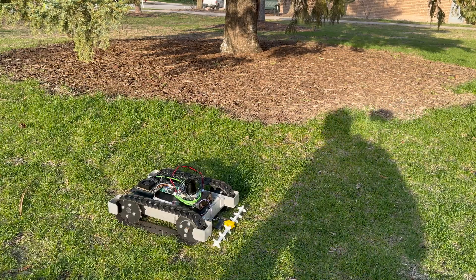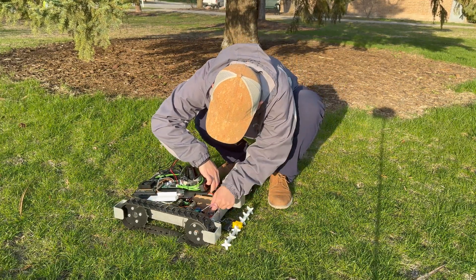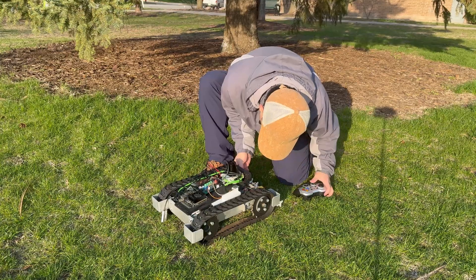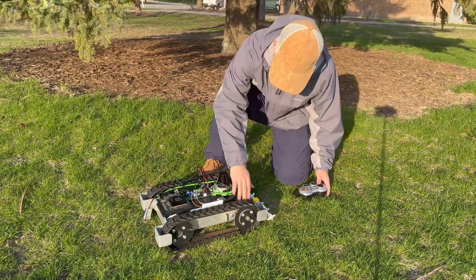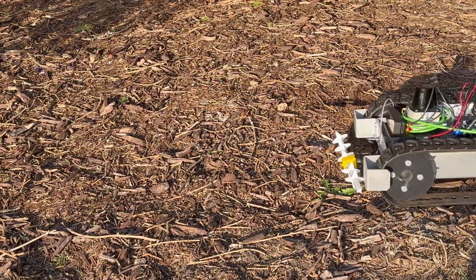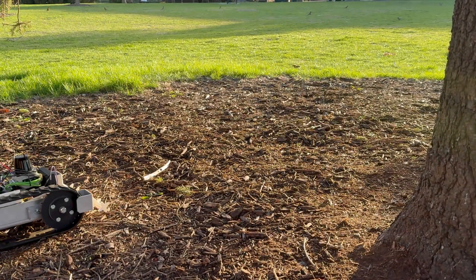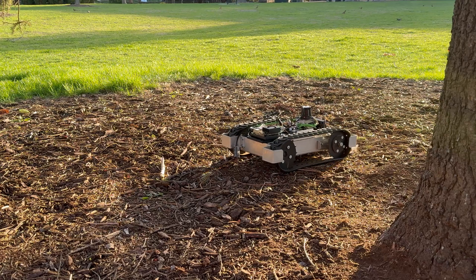I migrated the robot outside for outdoor testing. I'm not near any forest so it was hard to find good terrain. A lot of things broke — I didn't solder the motors well enough so connections were loose, and some 3D printed parts fell apart. There was a lot of debugging. Thankfully there was some mulch around the grass near a tree, so I tried to simulate pushing it away. The blades were too small for that, but the robot navigated the terrain pretty well. The 11-volt battery just wasn't giving it enough power though.